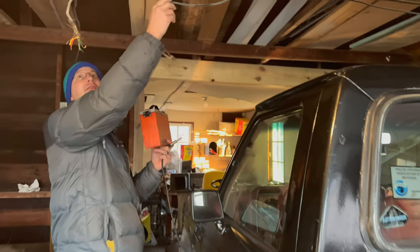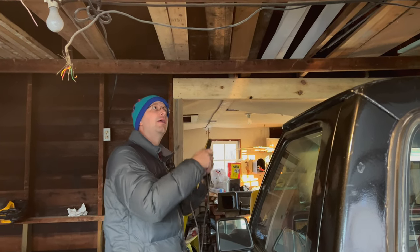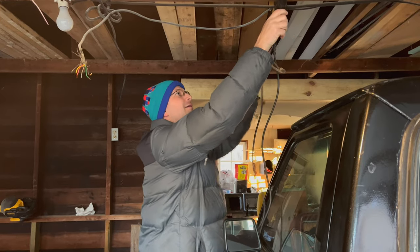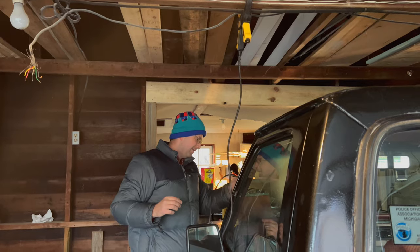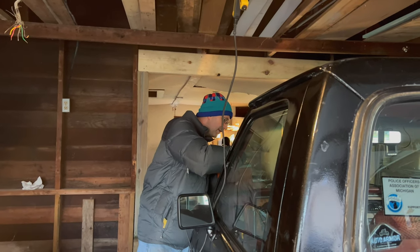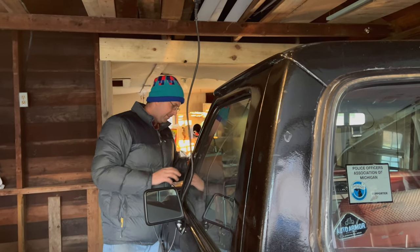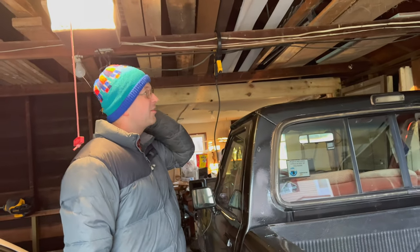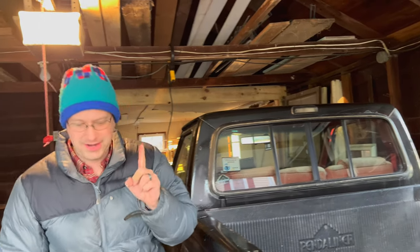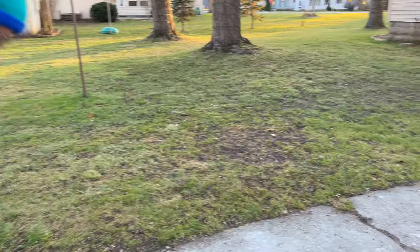Let's see here. Where is the wire? It's that one right there, the one that is not attached to anything. So that runs a signal artificially through the wire? Yep, and that way we can follow it underground using your locator. Hopefully, yes, we're going to find out. That's also inducing the one down the electrical wire, so I might have to change that, but we'll see if we can follow both.